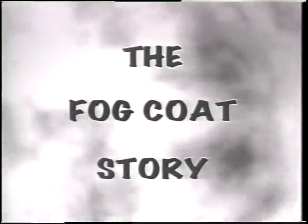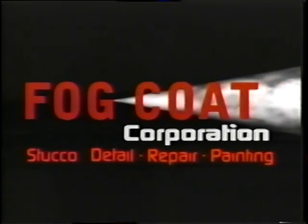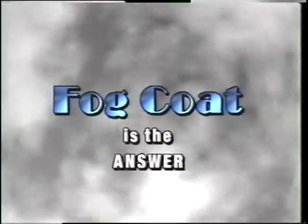Fog coat is a stucco product. It will not trap moisture like paint will. It is considered a 100-year product, and being cement, will hold up to weather elements for decade after decade. It looks better, lasts longer, and is comparably priced with paint. Informed HOA members know that when it's time to revive existing stucco color or to change to an updated color, fog coat is the answer.